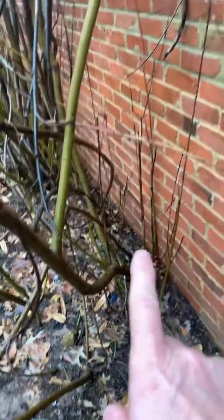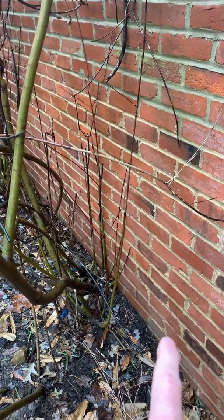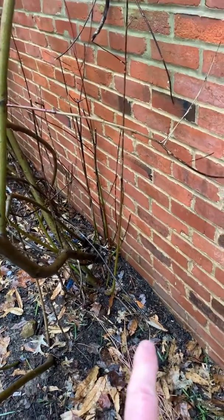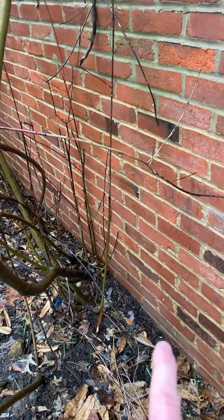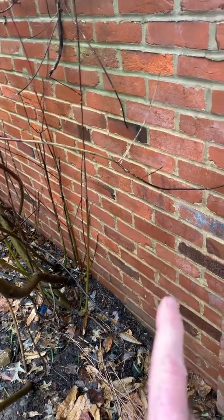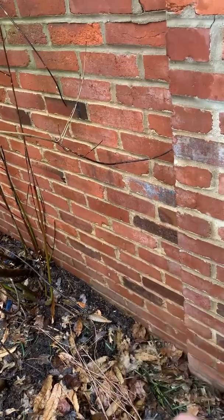And then this is where our unit will sit. These two bushes will be cut out, but it's going to go on this wall. We want to try for a bracket — this is a landscape bed and we just want to try and get this off the ground a little bit. It is some softer brick, but let's look into getting that on a bracket. The unit will sit where the lines connect right into this side, so let's double check that too.